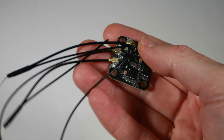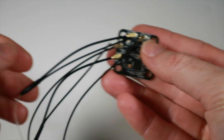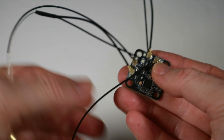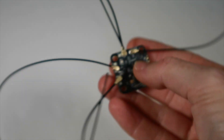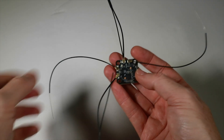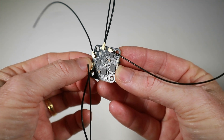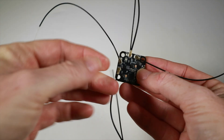To make use of these extra special dual band modes, obviously you'll need a dual band receiver. RadioMaster have brought out this one called the DBR4, and if we have a look at it in more detail, as you might expect it has two of the LR1121 chips and four antennas — two 2.4 antennas and two 868 or 915 antennas — which is quite a lot of antennas, and it looks a bit like a drunken starfish if you get all the antennas out. We're mostly flying quads with four legs so hopefully we can figure out where they can all go. It also has 20x20mm mounting holes which should go nicely on a stack, and in the bag you've also got some additional rubber grommets so you can get it nicely mounted.